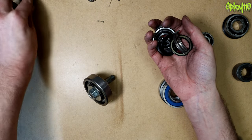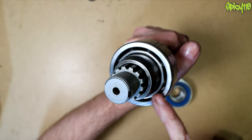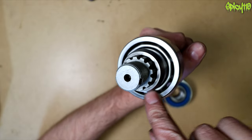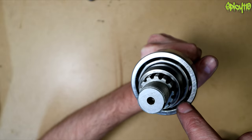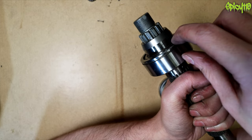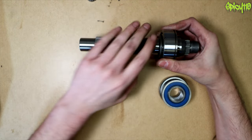We've covered standard ball bearings and roller bearing types for heavier applications. Before moving on to tapered bearings — this next one is slightly different. The balls do the same job between the outer and inner race, but instead of a cage that holds them from pinching in the middle, this one from a Yamaha R1 gearbox has a solid retainer with holes so the bearing can still run. That design keeps the rollers better retained — stronger and longer lasting.